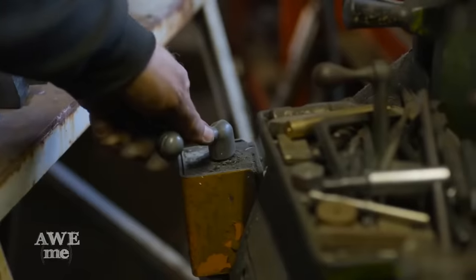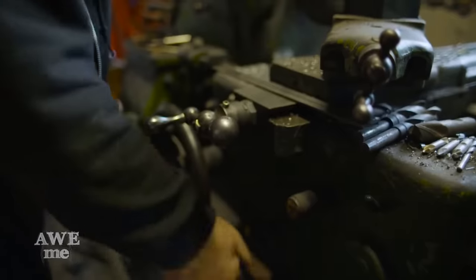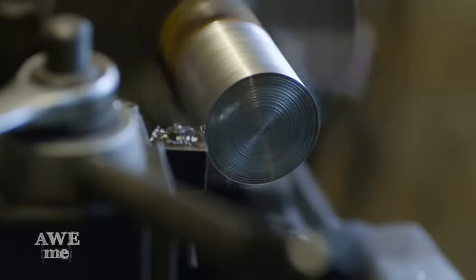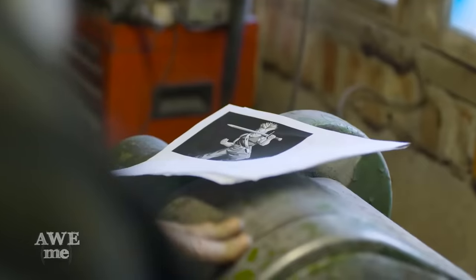On this sword, we're going to be turning it. We've got some free machining material. It's been laying around the shop for a while, so it's a little rusty on the outside. I'm going to put it up, take a powered pass across the surface to make it smooth and clean, and then I'm going to disconnect the auto feed and just freehand the entire shape.